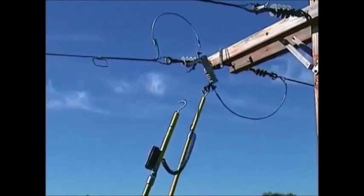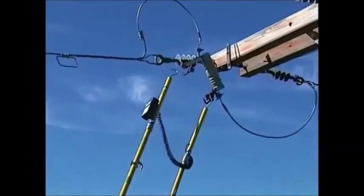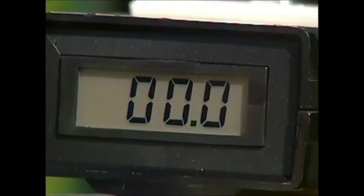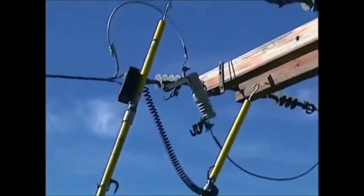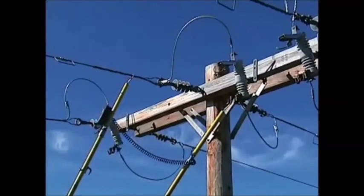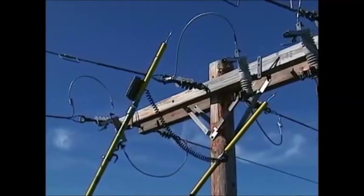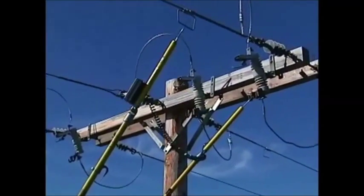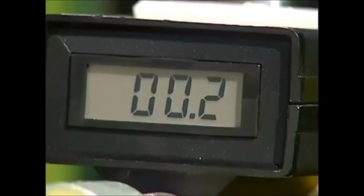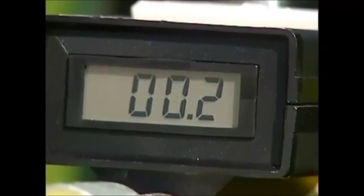While you're there, why don't we just go across that open switch you're at? I'm seeing zero voltage there, Kirk — that's the same phase. And at the next location I also see zero, so that's the same phase. At this location I see a small variance of 100 fluctuating to 200 volts, which also identifies it as the same phase.